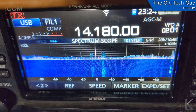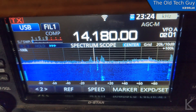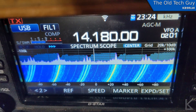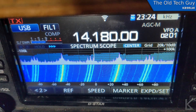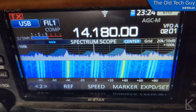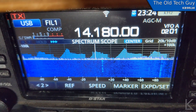Check this out. We're looking at 20 meters on an external antenna, and I'm going to turn on my inverter. There it is. It's a pure sine inverter, but that's what it does on HF. You could hear the two meter radio going off too — it's got all kinds of noise. Now I'll turn off the inverter. That's the kind of noise you get from an inverter. Additionally, with the 3D printer, it generates noise as well. When it's operating along with the inverter, I have noise on the two meter band that's just horrible — it wipes it out. I can't use it. I can walk 30 yards from the RV before the noise falls off, so it's really bad.